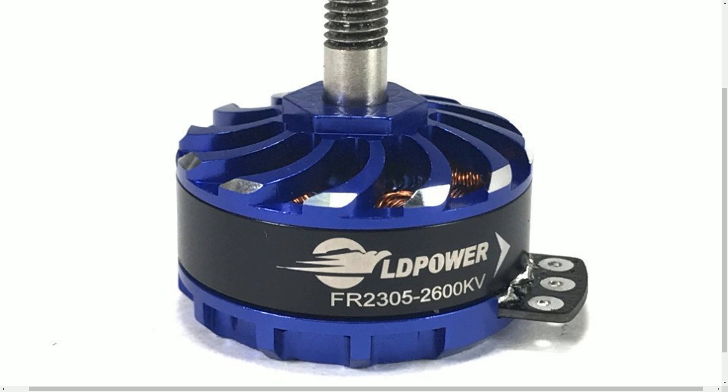The motors come with active cooling. These fins up here are designed so that with active cooling the fins sling the air outwards. Sometimes the fins are directional, which is the case here — they're designed to work when the motor spins one way but don't work as well the other way. If you look at the Brother Hobby Tornado motors, they have straight fins so the motors can spin either direction. Basically the air is slung outward due to centrifugal force, which creates a negative pressure area at the top of the motor, and air is actively drawn up through the windings and out again.